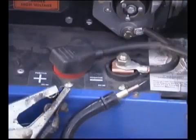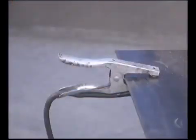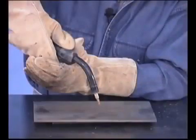That's about all there is to the fundamentals of welding with self-shielded flux core wires. Set the equipment up with the correct polarity. Have a good clean ground. Use both hands on the wire feed gun. Adjust the voltage and wire speed to allow the molten pool to spread out and tune for a short arc length. Maintain the recommended wire extension with the wire directed towards the front of the puddle. Use the gun angle and travel speed to control the amount of weld deposit, then travel at a speed that maintains a uniform weld puddle.